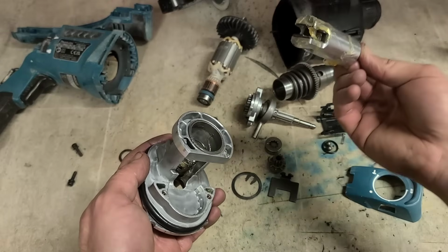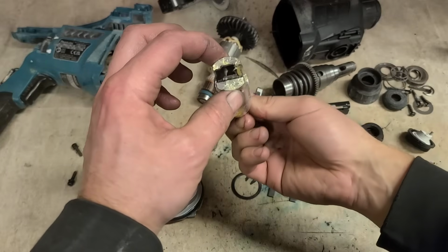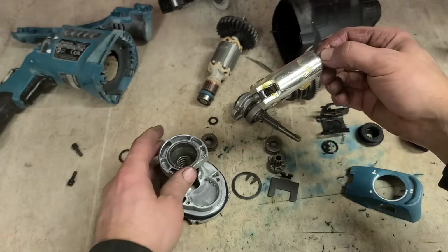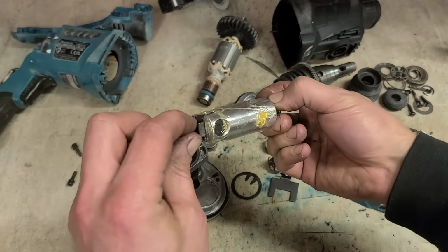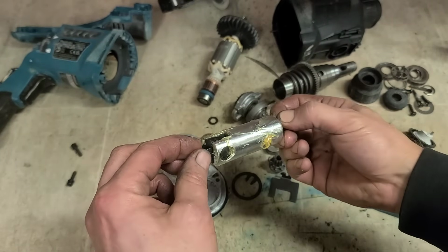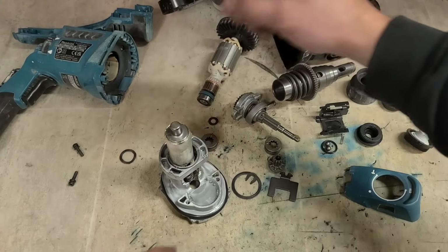And on top of that, you put your piston. Just take the hole in the center shaft, point it out. Now I know this is also aluminium on top of steel spring, but this here metal plate actually sticks out a little bit further, so the spring's actually sitting on this here, not the aluminium piston. So in the other models it doesn't have the spring, there's actually just two washers in there, it doesn't have this here plate. So that's going to sit there.